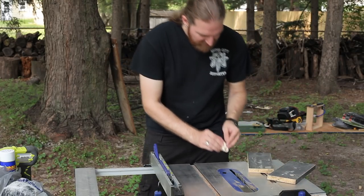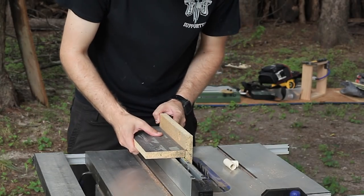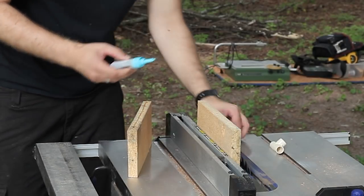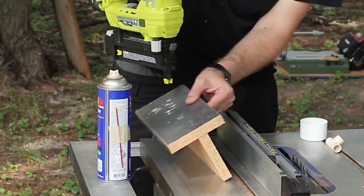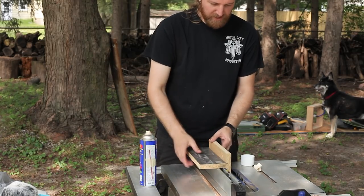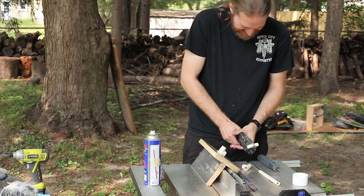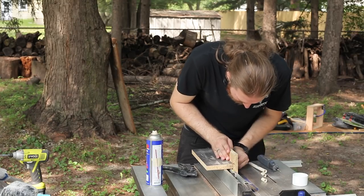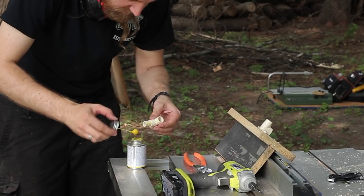All right, so I want to make something that I can basically take along the table saw and cut off, you know, a strip in the middle. So something that'll just ride along my fence like that. I can strap this to it on the edge. Put that the other way, whatever. That might be just right. There we go. Now that holds it on nice and level. Glue the one end in so it doesn't keep coming out.